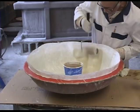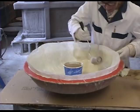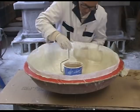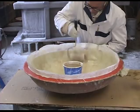In this product here, we've positioned the mat on the mold, and we've got the resin in the center of the product. What we're laying up is a little industrial product here, which is about two layers of 1 ounce mat. And we put no resin against the mold to start with. Because of the complications of the number of slits in the mat, we tend to do it this way. This is called dry laminating, where you have to force the resin in only one direction through the mat. You can see how the resin's starting to soak into the mat, changing color.